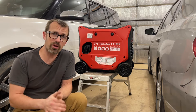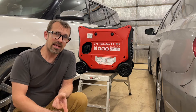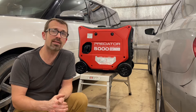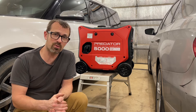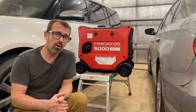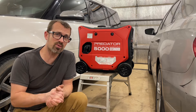The normal things I do to all of these are: I run synthetic oil in them after a break-in period, I run a magnetic dipstick to help collect anything since there is no filter in these, and I also upgrade to an NGK spark plug. I will put a link in the description to the NGK spark plug as well as the magnetic oil dipstick cap, but I'm not going to cover those in this video.